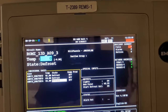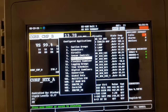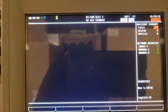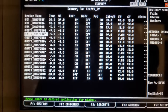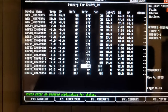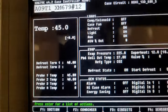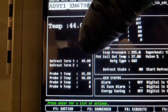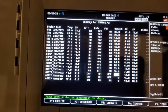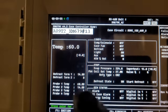I want to see my sensor reading, so I'm going to go back here like I learned yesterday. Configured applications — number 12, 13, and 14, that's those cases right there. The case on the left: defrost termination is at 49. The case in the middle that I'm working on: defrost termination is at 14, because that one hadn't come on yet.